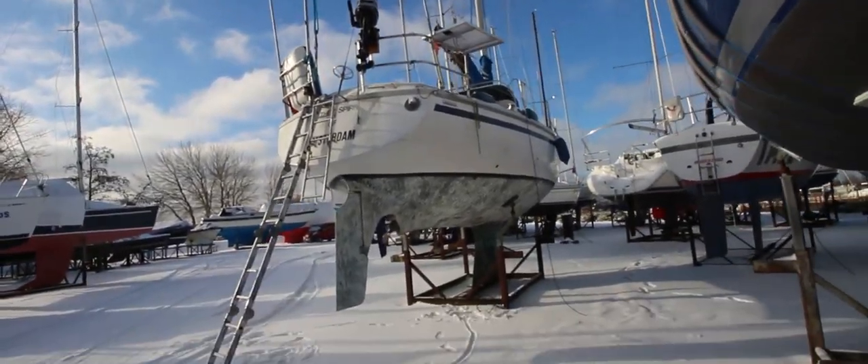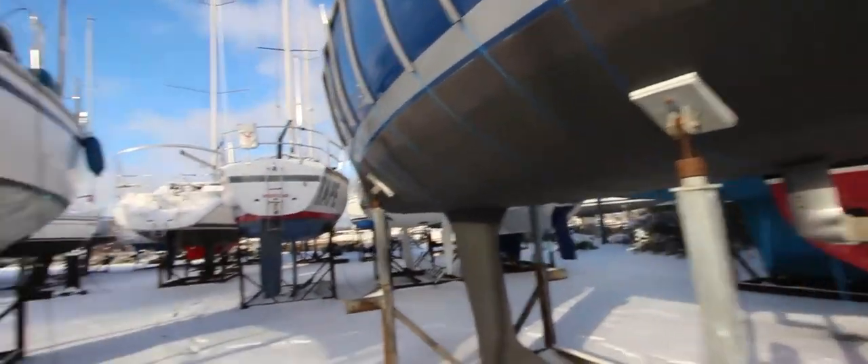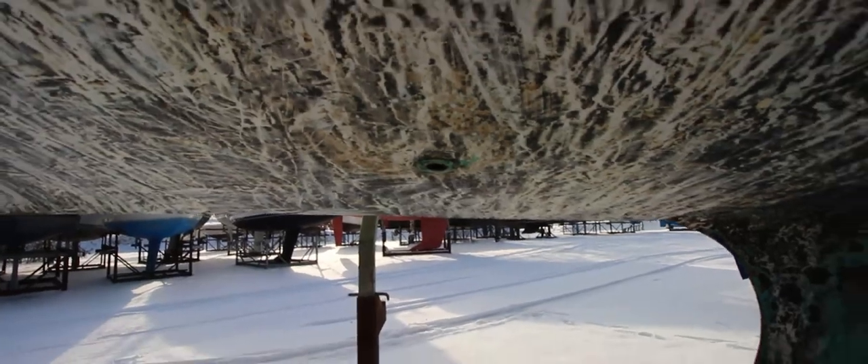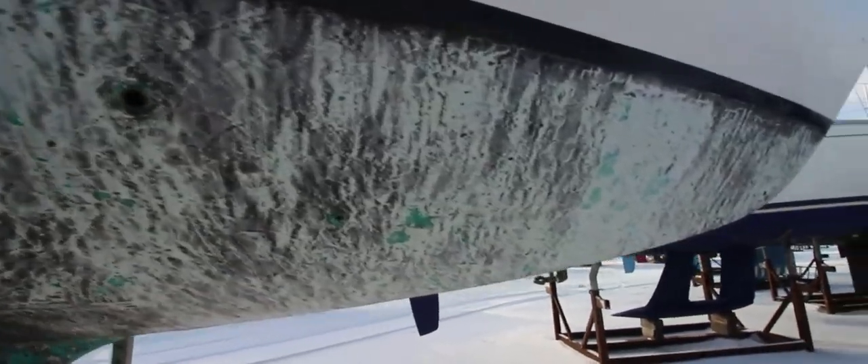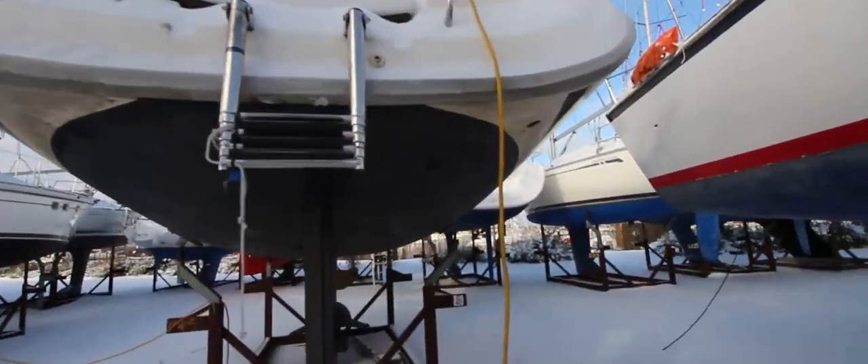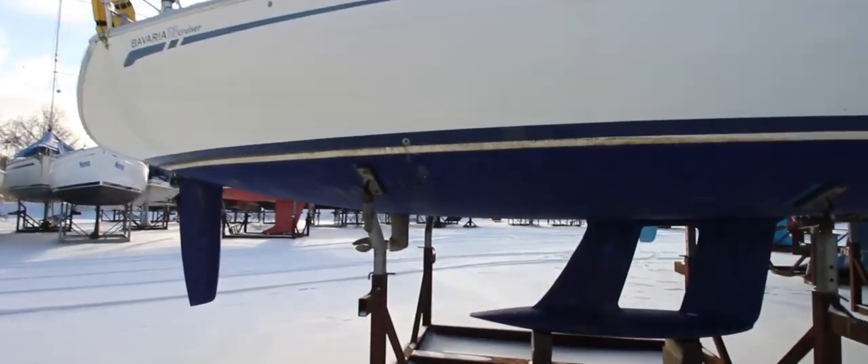You can also see that every hull has a bunch of holes in it. So these are some exhaust holes for the engine. This is the kitchen drain. Then we also have some input holes here — this one is to bring water to the engine, for example. And here we have another one which is for the forward heads. With all the boats, if you look at the bottom, there's always a bunch of these through-hull fittings to either let out or let in water as needed.